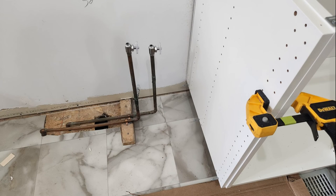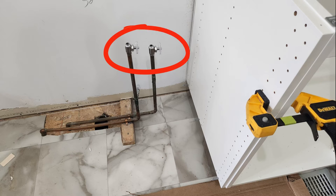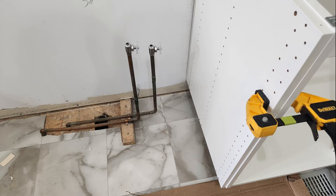The example I'm using is this one. You can see there's two water pipes sticking up from the floor and there's a drain pipe tucked away right next to those pipes. And if we did not have those valves on top of the pipes I could just assemble the cabinet, but since we don't want to have those big holes at the bottom of the cabinet, I need to have a different approach and what I often do is I build the sink cabinet around the pipes.